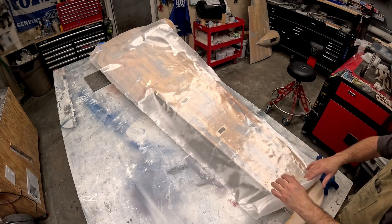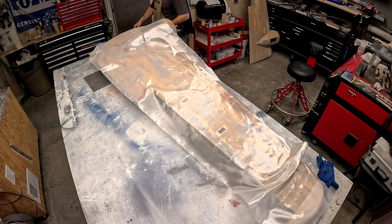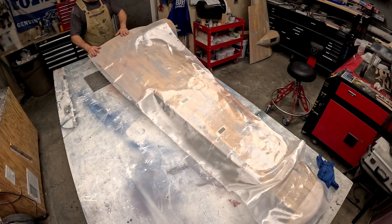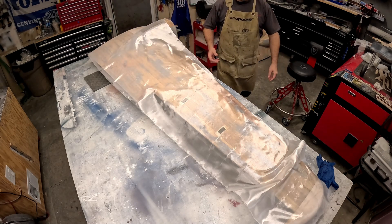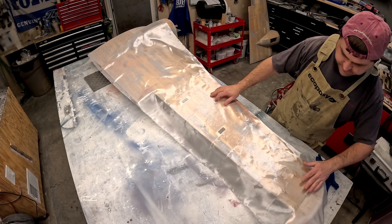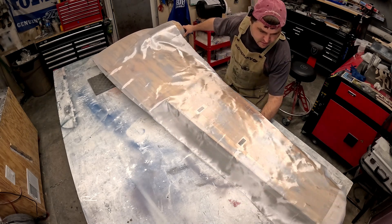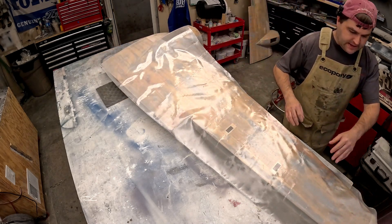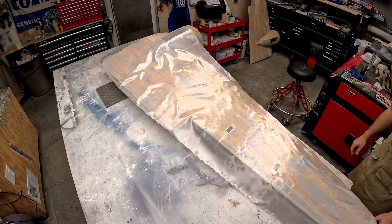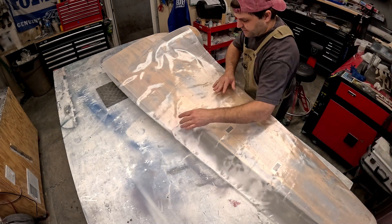Then I'll slowly start doing a little bit of trimming here and there to get it where we want it. There's a big hump in the middle — that's the nacelle — we'll have to take care of that. The overlap on the back isn't quite as important since that will get trimmed off pretty flush. I typically leave more overlap at the wing tip than at the wing root, because you have to go around the corner. I'll hang the wing tip over the edge of the table and use clamps or clothespins to help drape it across the curvature of the wing tip.